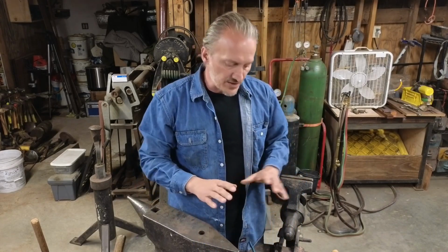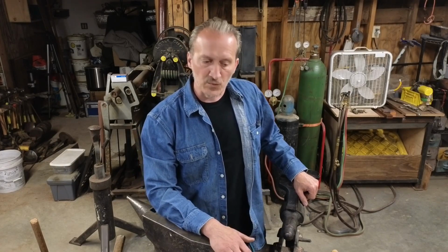With the blanking dies, when you cut these out, typically it's done with a jeweler's saw. And I've heard of people doing them by hand, but I'm not sure how well they work. You just need to make them out of a heat treatable steel if you're going to be using them for cutting metal. The ones I've made have pretty tight tolerances, so they can shear really quite thin material without it smearing into the gap. When you're cutting with a jeweler's saw, if you cut vertical with the blade, you're removing the thickness of the blade, so it leaves a little bit of a gap between the two pieces of metal that you've cut. And so it has that opportunity to smear the metal down into the groove.